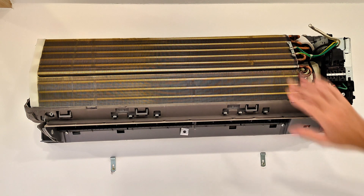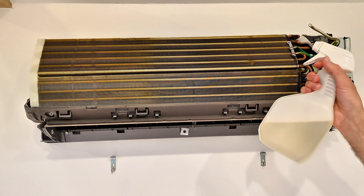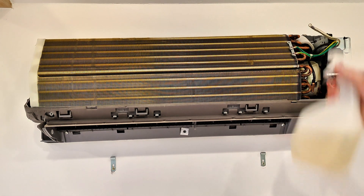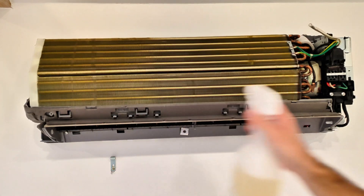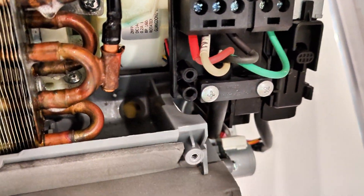When you're doing your leak test, you want to check everywhere where this copper pipe runs. If you're using soapy water, check for bubbles — spray all along the sides and throughout the middle. Also, you don't need to worry about water dripping; it's all going to get collected and run down your condensate drain tube that goes outside.